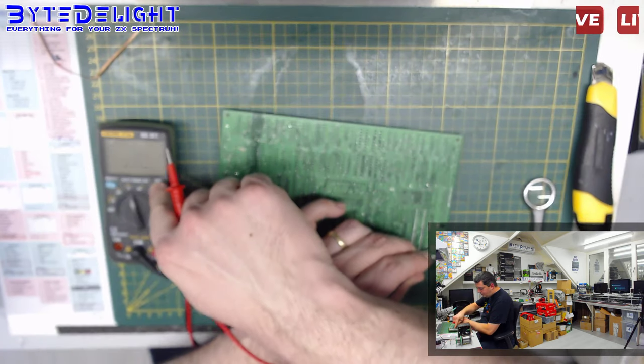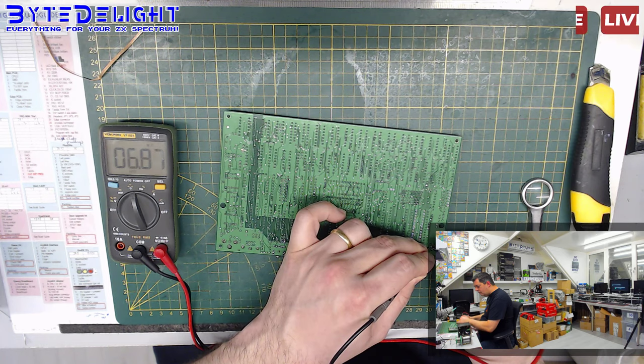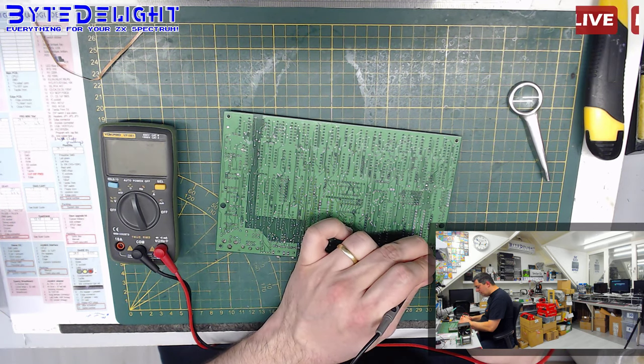Oh, my bad. Sorry. Should measure something. So it's in megaohms, 7 megaohms, and it's fluctuating a bit. That's because it's the input of the 5 volt regulator. And on the 5 volt line, we should get quite a high number because there are no chips on the board. You can see the number is fluctuating as well, but it's in the tens of kilo ohms.